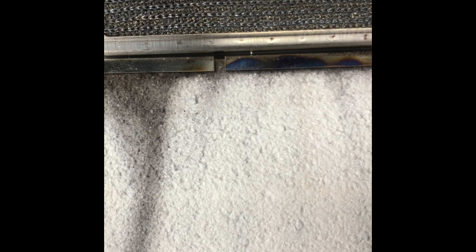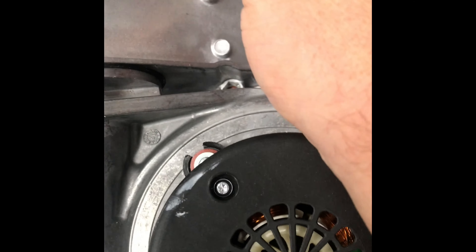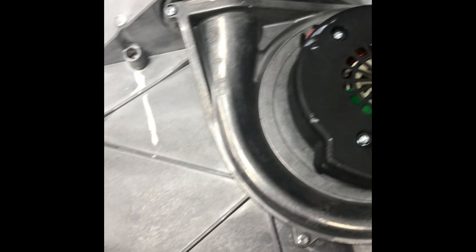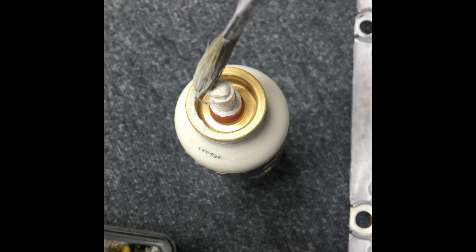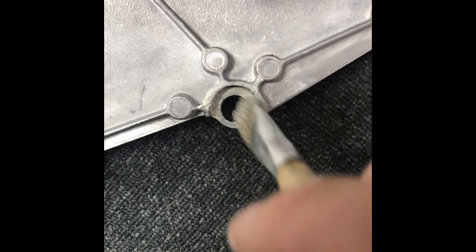Check the burner hasn't gone baggy. Push the bristles down so it doesn't cause ignition failure — fault code F4. Check the fan and check the earth, top right, behind the burner. Check the earth spring is still there, or you'll get an F5 fault. Before you put the door back, always put ceramic grease underneath the bolt or nut heads. This allows the combustion door to move slightly and prevents creaking. See you next time.